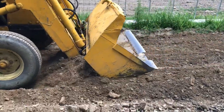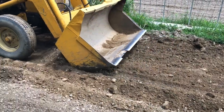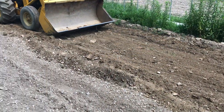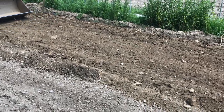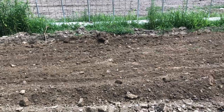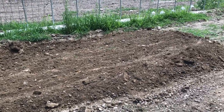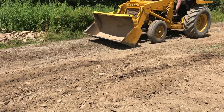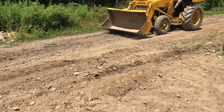You can see the tires will keep everything flat and straight and evenly distribute that dirt. Once the dirt is loosened up, just by going back and forth with the tractor, you'll eventually get all the bumps leveled out and it'll look like a road.